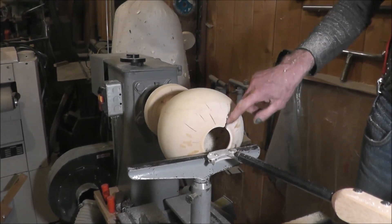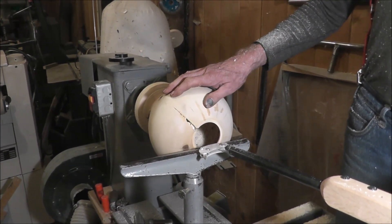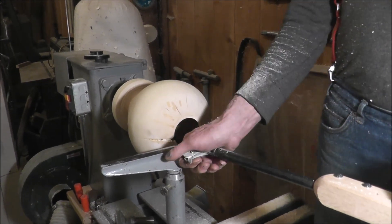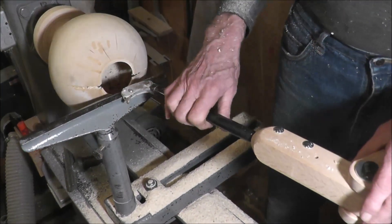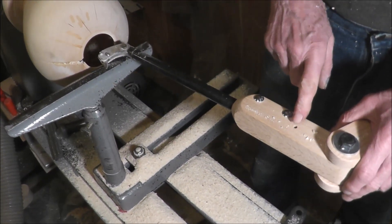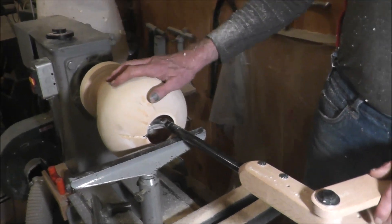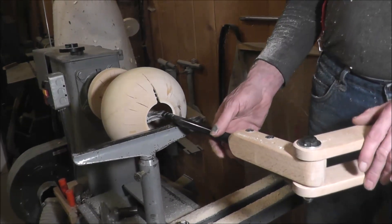Okay, as you can see this wood was cracked, so you're getting all kinds of vibration with the tool bit. This time the boring bar turned a little bit here, but if I'd had the pin in there it wouldn't have done that. With that chattering and those slots in there it put a lot of force on it, so if you're doing stuff like that I highly recommend slotting the end of the boring bar and putting the little pin in — then there's no way it's going to move. But other than the vibration because of the bad piece of wood, it worked very nicely and smoothly.